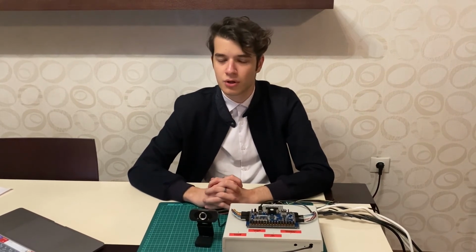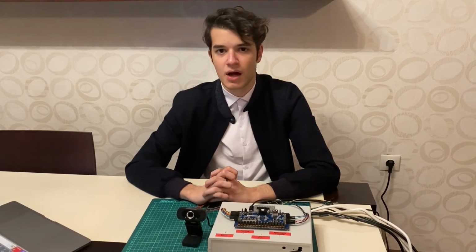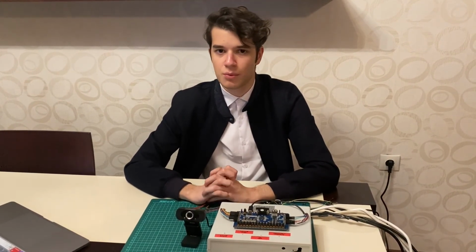The reason we inverted the signal is because the LDR sensor gave a logical value of 0 when the plasma breakdown condition occurred. And I thought for it to make sense, it would be better to have 1 as the breakdown value. The third module's goal is to control the 7-segment display. I was able to print breakdown and error when those conditions occurred, and at the same time, during the operation of the reactor, I was able to introduce a counter for the operator to see.